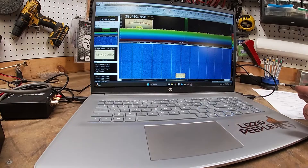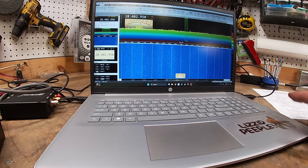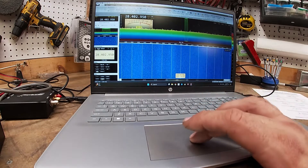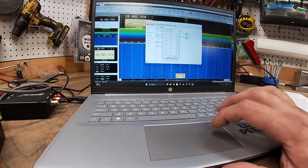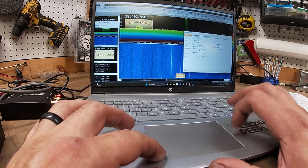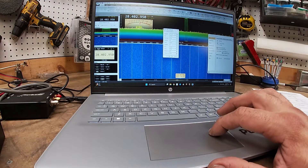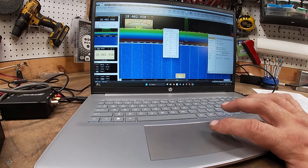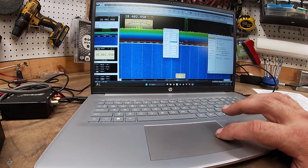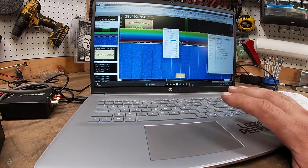There's a bit of software you have to install to get the radio to communicate with the program. If you already have your cable set up and a logging program that tracks the radio, you should already be running OmniRig. This is what interfaces between the computer and the radio. Here you have the model — the 991 — whatever the applicable COM port is, the baud rate, data bits — all the stuff you usually have to set up for a COM port. You have to make sure it's matched to the radio and the port's correct. There are lots of videos on how to do that.